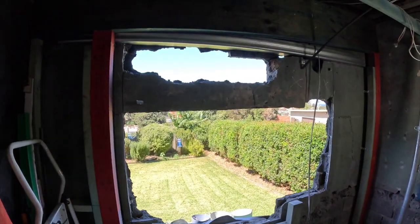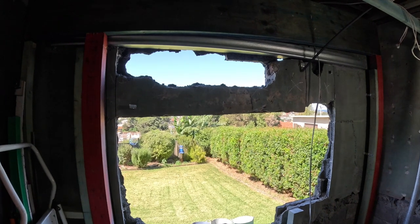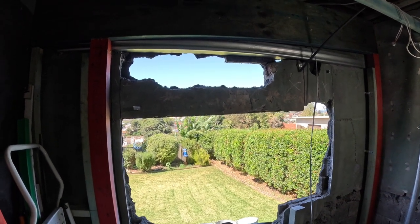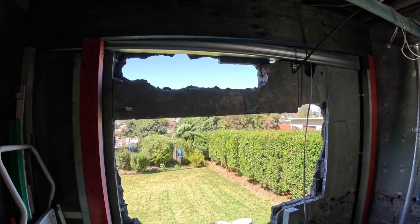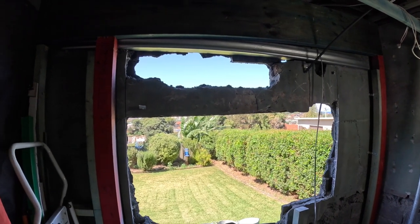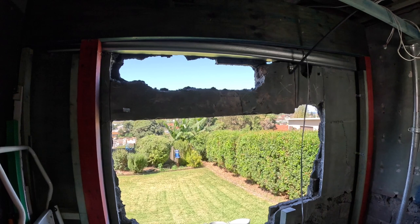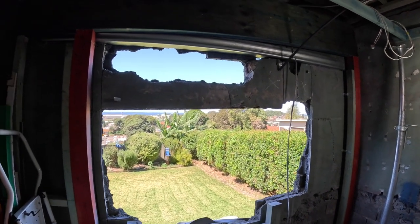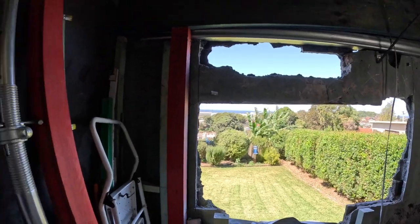There is a concrete lintel in there. I'm going to be careful trying to take that out, because if that lets go and is hinged at one end or something, for example, it could tear out a whole big lump that I don't want missing. Other than that, it's going pretty good, but I do need to cut it soon.